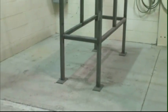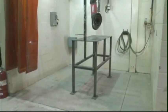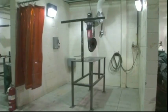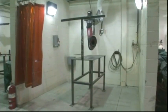Before you begin cutting, be sure your work area has a fireproof floor. Concrete floors are recommended. Heat-resistant shields, like fire blankets, should be used to protect nearby walls or unprotected floors from sparks and molten metal. Adequate ventilation is required to prevent a buildup of oxygen, fuel gas, and toxic fumes. Workbenches or tables used during oxy-fuel cutting must have fireproof tops. Fire bricks or heavy steel grating are good cutting surfaces.